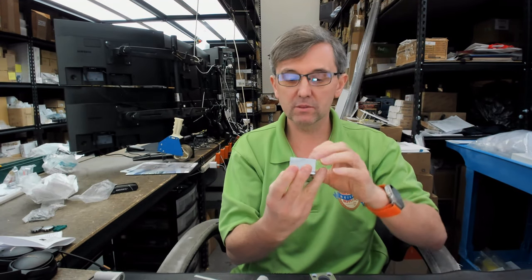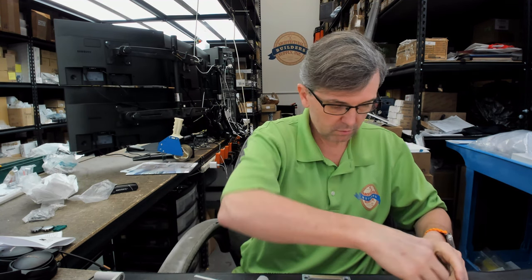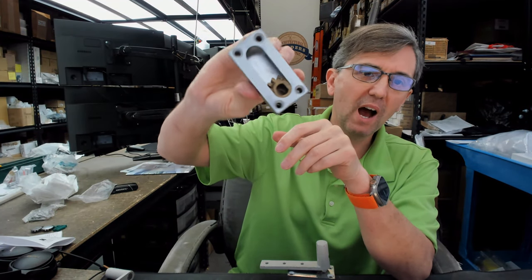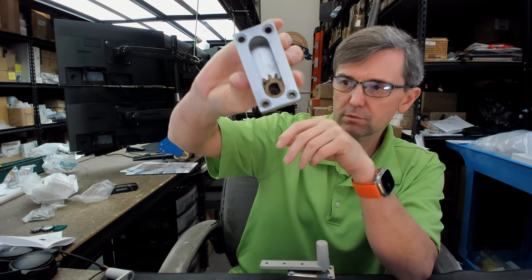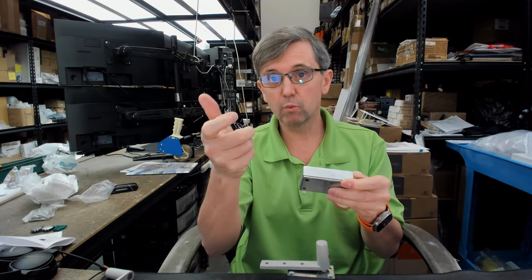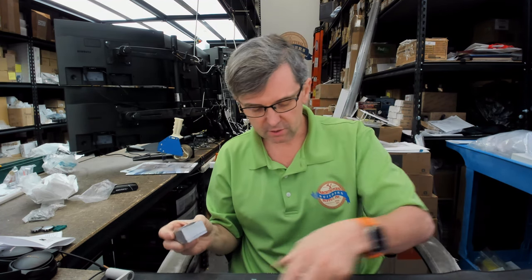You've got the two castings. And to go along with that, you might need to change the side of where the pinion is. So you're going to want to test the operation before you secure the boxes in place, because you might have one trying to turn in one direction and the other not timed correctly. So you'll get a couple of cases.